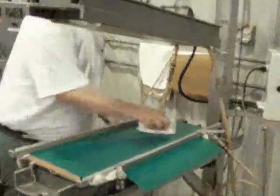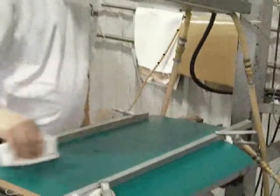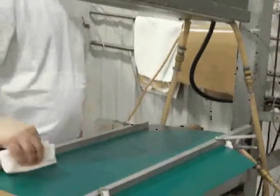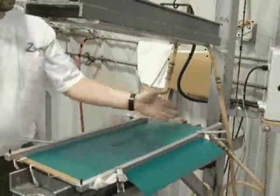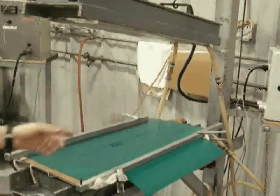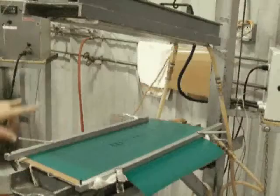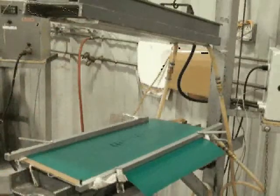When cleaning the belt, you want to use either denatured alcohol or some form of isopropyl alcohol. This ensures that no contaminants are cooked into the cover of the belt. When placing the belt in the press to be cooked, make sure that the finger splice is in the center of the 2 platens.